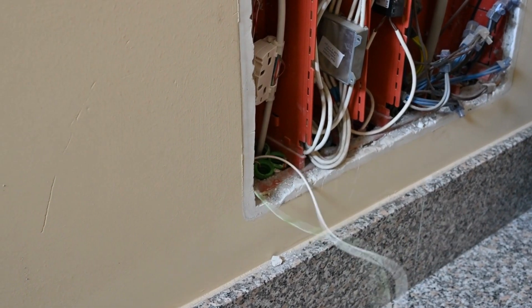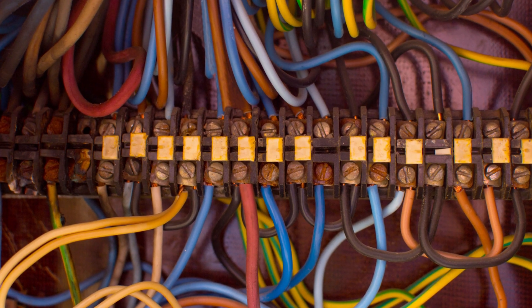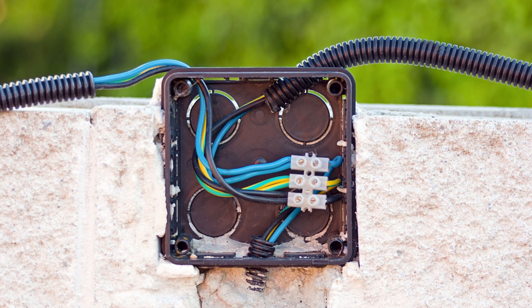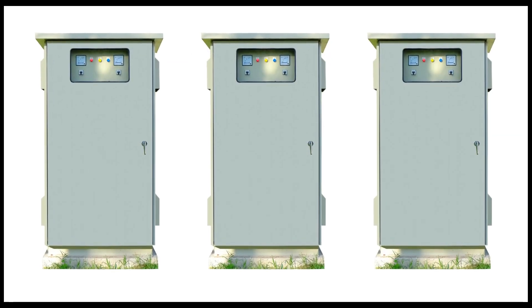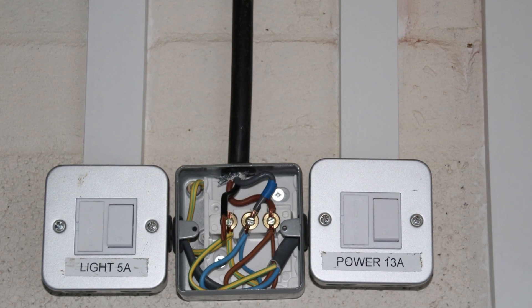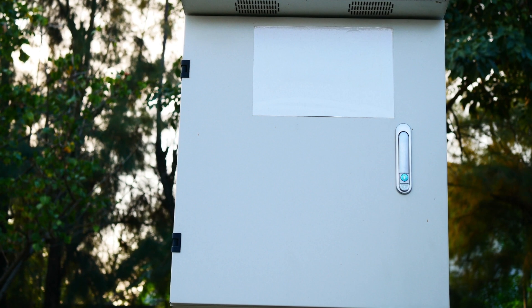What if the box is located in your attic or the basement? Old houses have these boxes in the basement, while some designs call for the same to be in the attic. Can a junction box be covered by insulation? The answer to this isn't present in the NEC, but other code books state that conduit or other insulation enclosures can be installed in a way that the electrical box is accessible without having to remove any part of the structure or excavate any ground around it. In this article, we will dive into the numerous intricacies of covering a junction box by insulation.